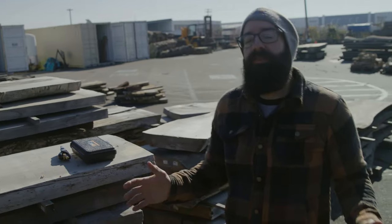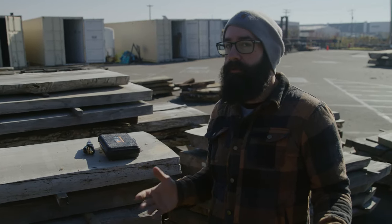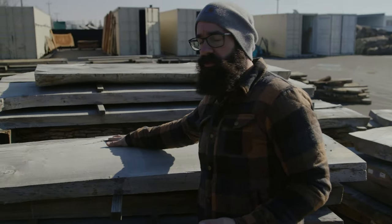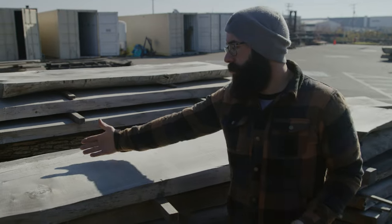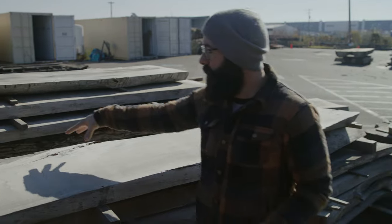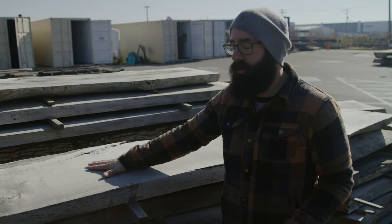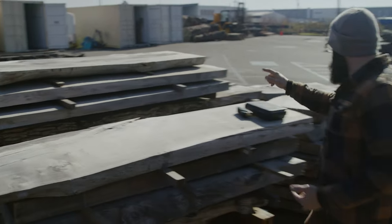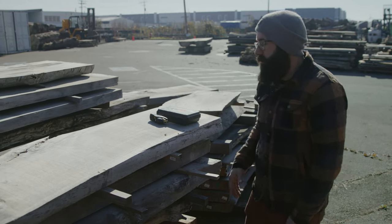The wood I need — I'm trying to build a six-foot diameter dining table, so I need at least six and a half feet of good usable stock. And a lot of this stuff you can see here is just checked so bad that not much of it is going to be used. Basically all of this would have to get tossed. If it's damaged on the outside, it's probably damaged on the inside too, with a lot of internal checking you can't see from the surface. Also, from here to this corner you have a huge amount of bow, so this piece doesn't look great.